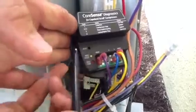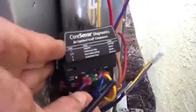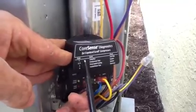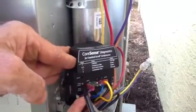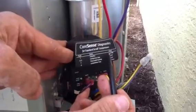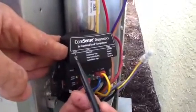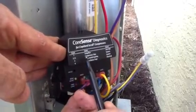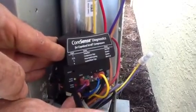I want you to look at this very closely. This here is the flash codes. One flash — these are going to be your run alerts. One flash means you've got a low-side issue. If you have between two and five flashes, it's going to be a compressor trip — it's going to be in trip lockout mode.